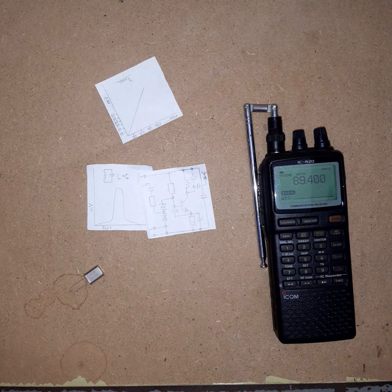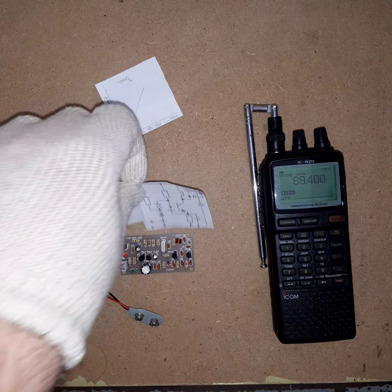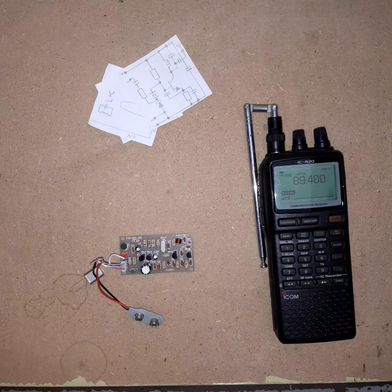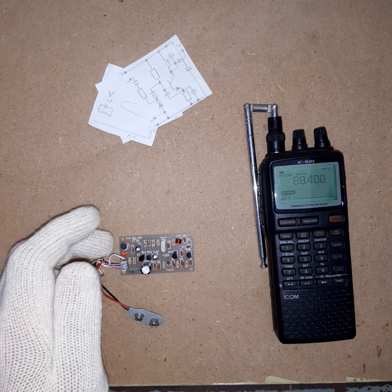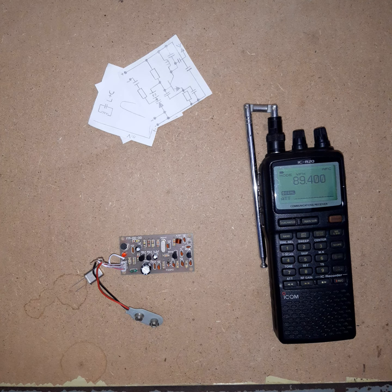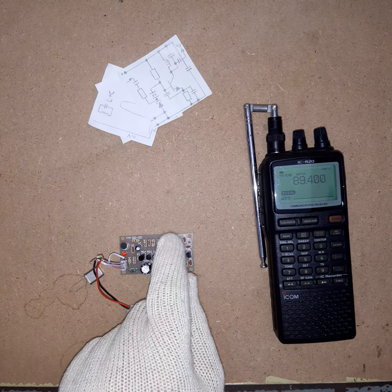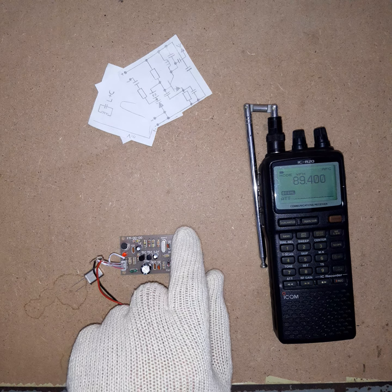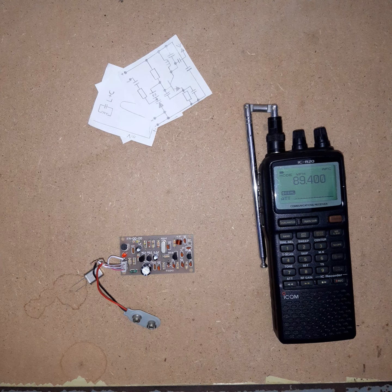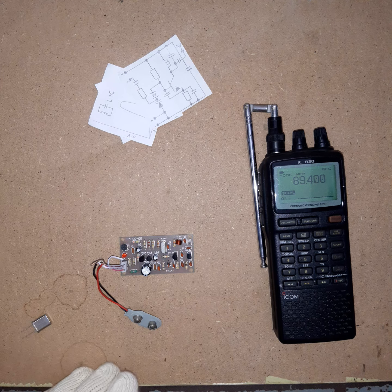This is exactly what industry did, and here is the circuit or the board, and this is a crystal-controlled FM transmitter with a built-in microphone. Seems like it's one of these spy-bug transmitters, as it only offers you a microphone as audio input. Here you can see the crystal, the varicap, and here you can see a coil and a capacitor. Both are in parallel and form a so-called resonance circuit, which is tuned to the desired frequency. In this case, it is 90 megahertz.